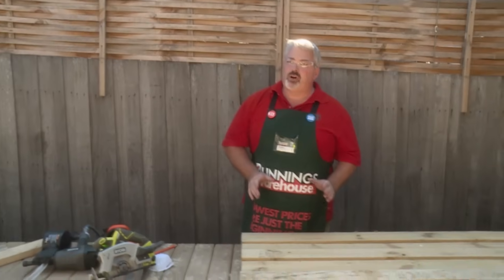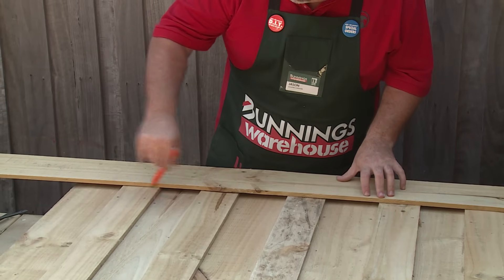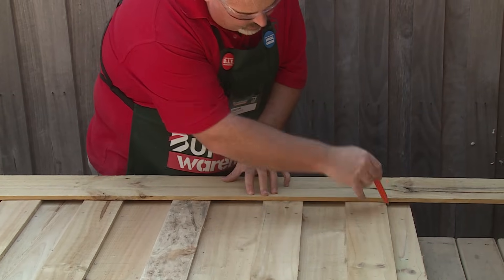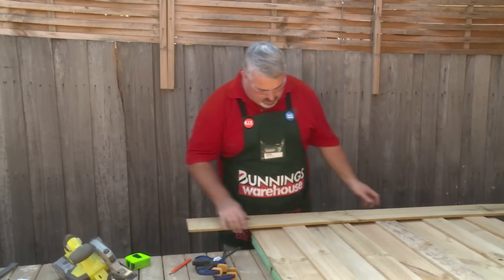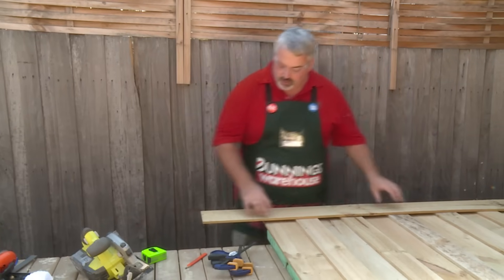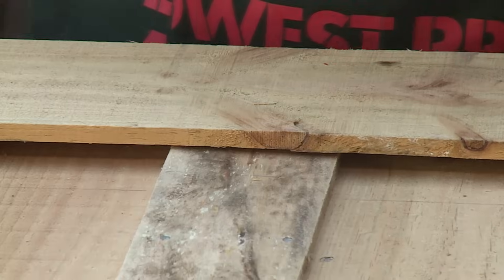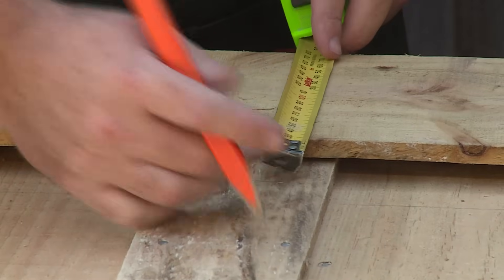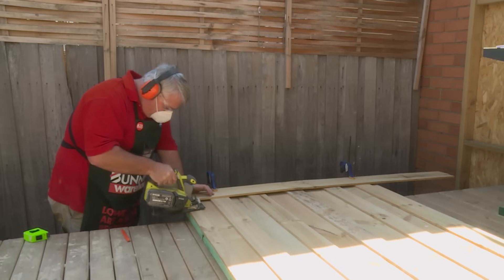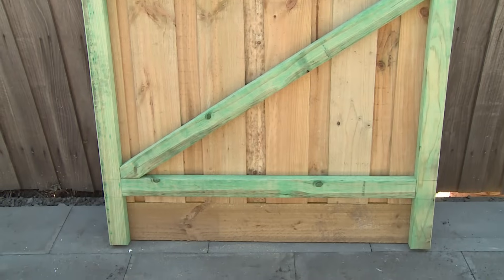Now that I've shot all the palings on, my next step is to mark and cut a nice clean line across the top at the finished height of my gate. I'll use a bit of off-cut timber as a straight edge, clamp it down, and run my saw along it for a nice straight finish. I know that from the face of my blade to the outside is 36mm, so I measure 36mm from my finish line at both ends to run my saw straight along that edge. That's how easy it is to build your own gate — it's now ready to be installed.